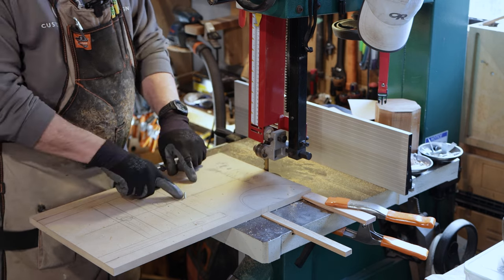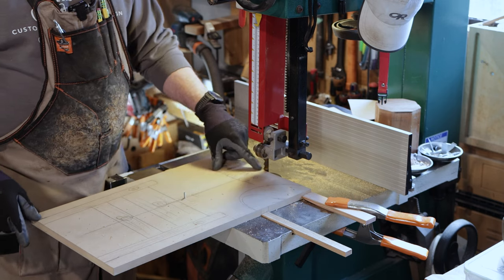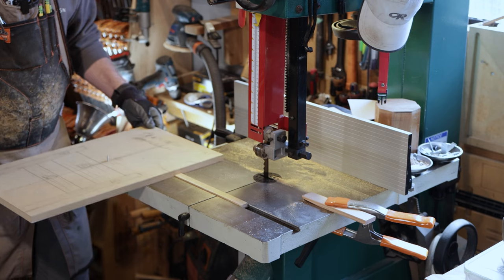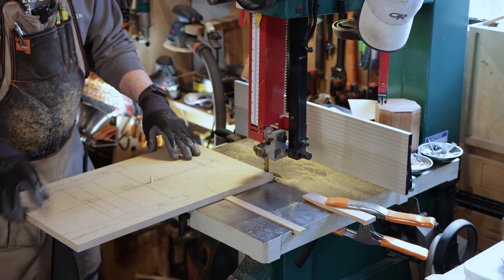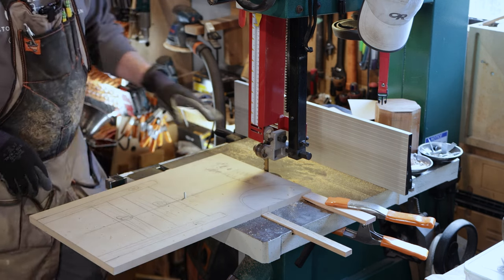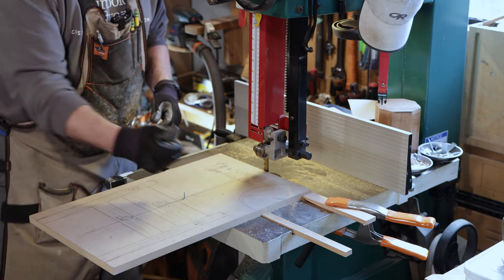The biggest thing is to get your pin in there, whatever you're gonna use. I use a screw because I got 9 million of them. I have a center line, and make sure that when you start, give yourself a long enough tongue on this, for your bandsaw at least, to come in and cut everything off. Your template is square. You wanna cut into it, stop right on the center line and then spin it. And then make sure your fence is out of the way so you don't have to do what I did right in the middle of working. Stupid me, but all right, there we go.